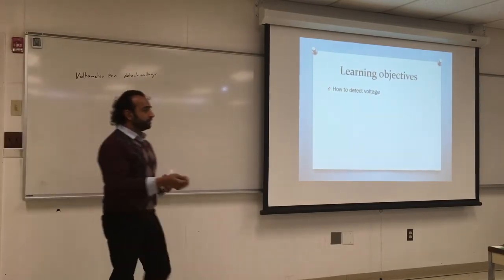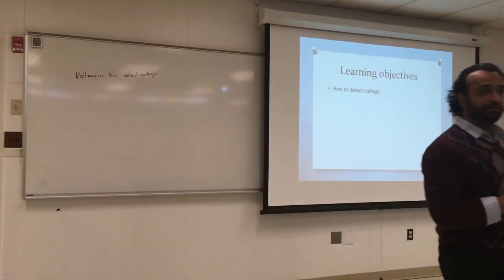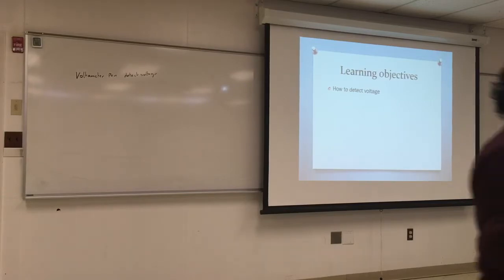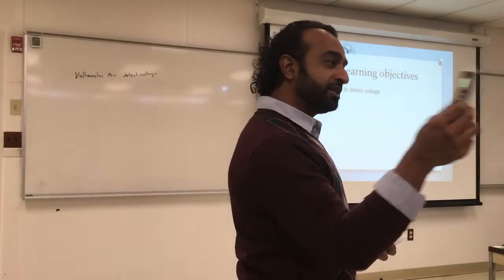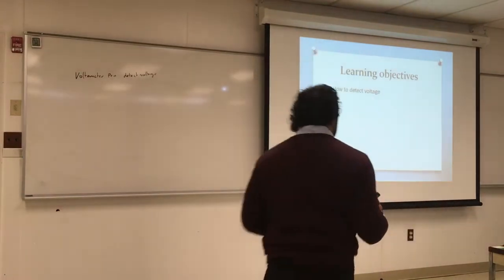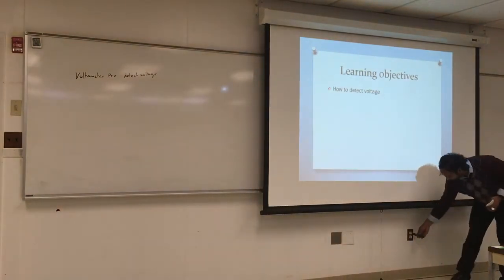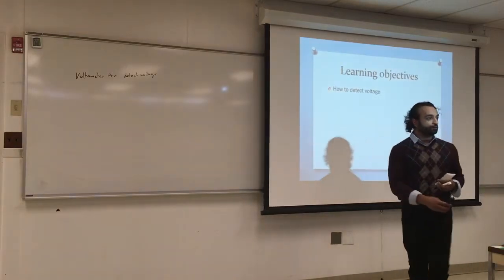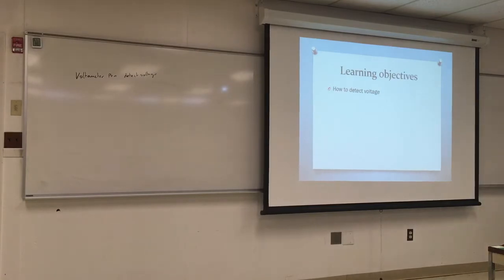How do we use it? You stick, does anybody have it around? Yeah. Multimeter pen. It's important for two things: knowing if there's voltage or not, and also knowing which is hot and which is neutral. Let me see. Okay. So if you see there's a small little tongue on top of it, that's how you will know which side of the receptacle is hot and which is neutral. So if I stick this in the hot, it makes a noise, neutral, nothing. So hot and neutral. Everybody got that? Yes. Fantastic.